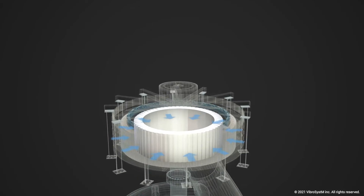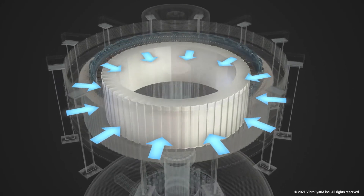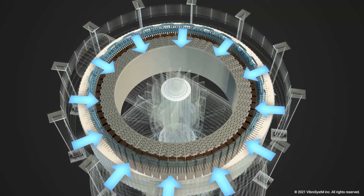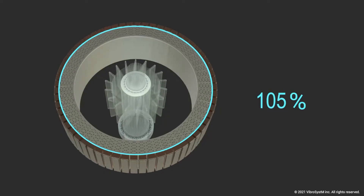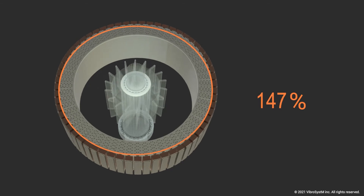The results were analyzed, and the OEM went back to the drawing board. They increased the constraints for the rotor rim to ensure it would start floating at a higher speed, thereby avoiding the 90 RPM operating limit. The modifications were performed by the OEM and new tests were conducted.